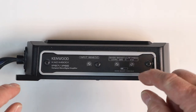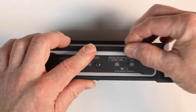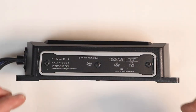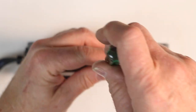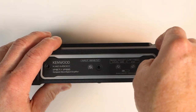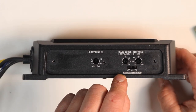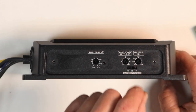On the side of the amplifier you'll see what looks like controls, but they're not. It's a rubber gasket all around with three screws holding it in place. They've silk-screened it so you know where they are rather than making it invisible. Be careful when taking the screws off because there is a washer — you do not want to lose it. If you look closely at this end you'll see an arrow and a little pull tab, as it's really hard to get up otherwise. Input sensitivity is between 5 and 0.2 volts. The bass boost selectable frequency is set with a DIP switch — 40, 60, or 80 hertz — and there's your low-pass crossover.